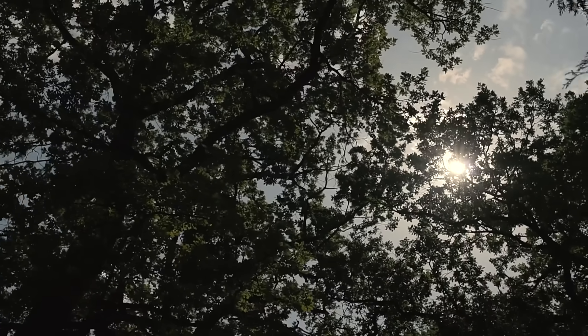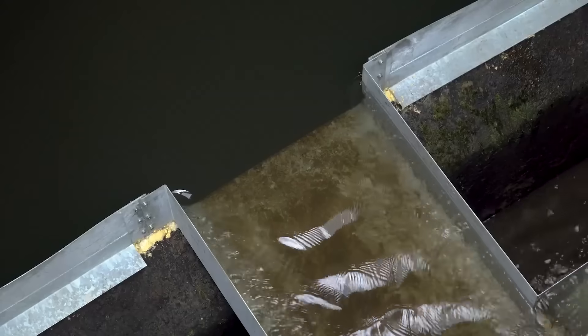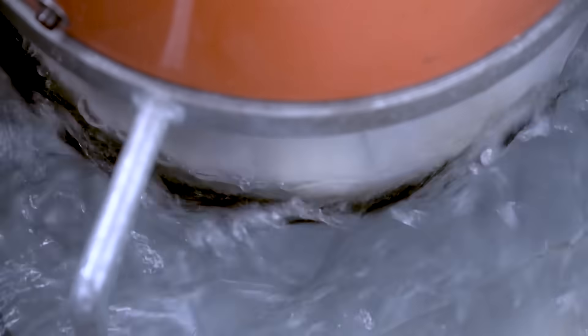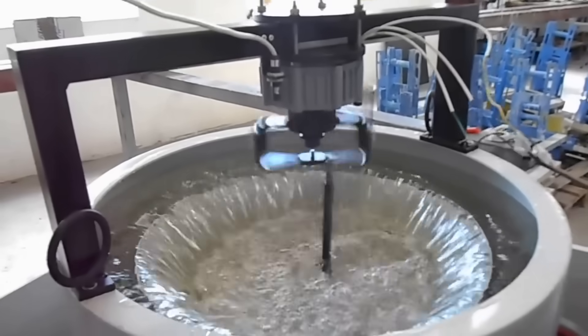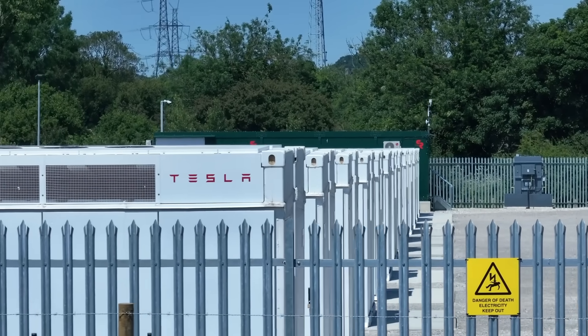Whereas small hydropower can average over 50% of full power as the rivers keep flowing. This means for $5,000 we would get 50,000 kWh from solar, and for $22,000 we would get 150,000 kWh from the bladeless hydro turbine. This works out as 10 cents per kWh for solar and 15 cents per kWh for the hydro turbine. However, because the hydro turbine can run 24x7, there is much less need for expensive batteries to store the energy.